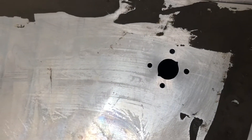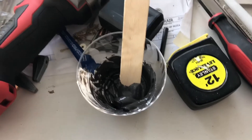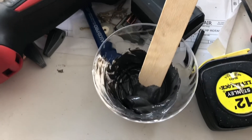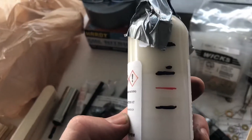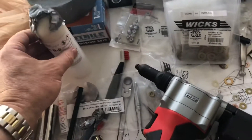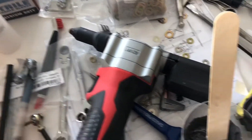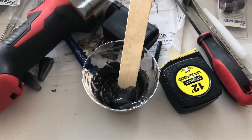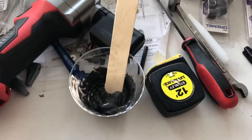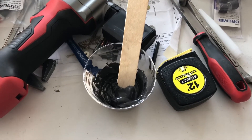I don't want to block the little hole that causes the drain to work, so only around the edges. On the rivets, I've got special rivets that seal, and I'm going to dip those in ProSeal as well when I press them in. I've got the ProSeal mixed up and I'm getting to know that lovely color. I use just a portion of these prepackaged dispenser tubes so I don't waste a whole batch. I do have a sense now for the familiar smell of building a BD-5 — MEK and ProSeal.